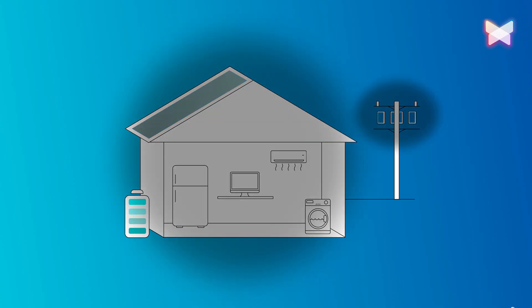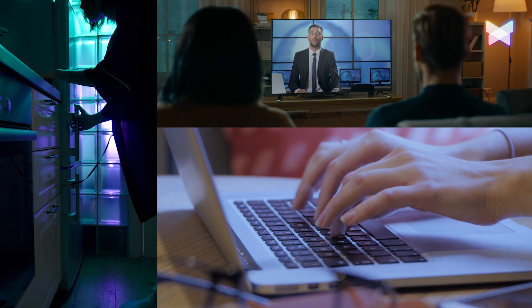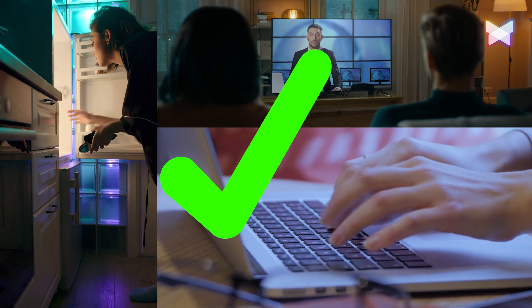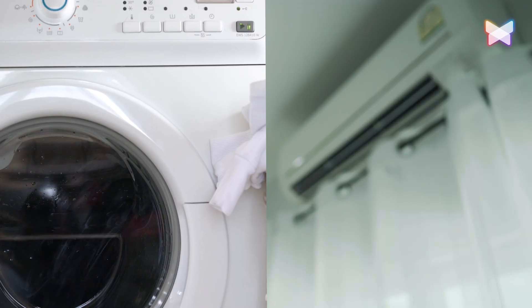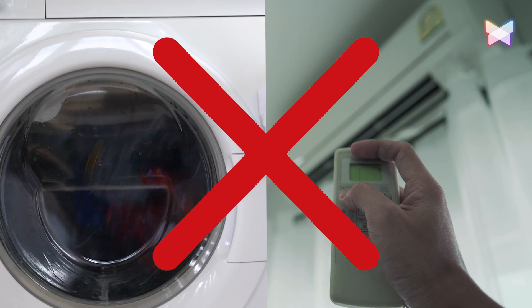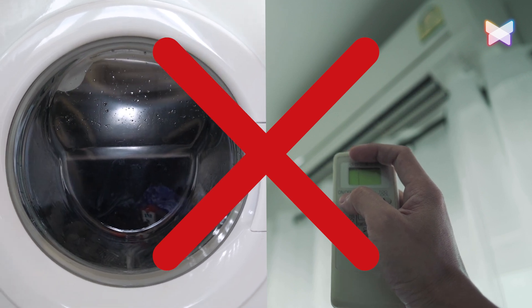This is achieved by having a secondary circuit connected to one fuse in the meter board, allowing the battery to provide power even when the grid is down. Typically the blackout protection circuit includes essential appliances like your fridge, a few lights and some power points for charging phones, computers and keeping your Wi-Fi running. However it's important to note that this circuit does not support energy intensive appliances like air conditioners, dryers or hot water pumps.